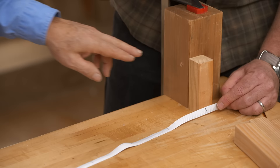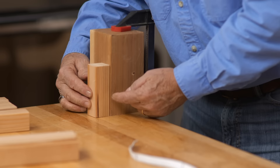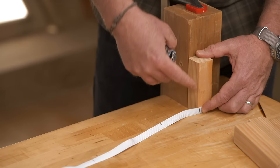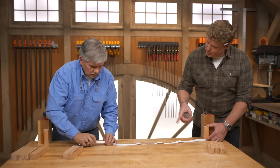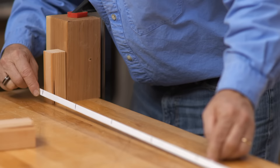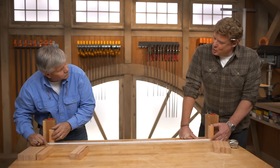The key is that you have to think of each post as a baluster. So this baluster here and this baluster here — you don't want to measure in between the two. You want to measure from the right side of this baluster to the far right side of this baluster. If you take this elastic and bring it over to this line right here, watch what happens when I stretch it — all of those four-inch increments will grow equally over the length of the elastic band.